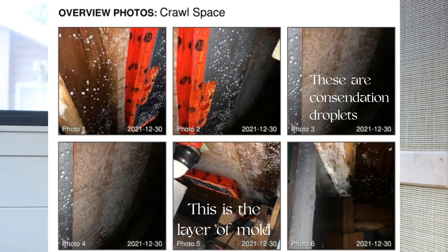Basically what happened — the reason why all of this started — was one day my water froze. I do have an insulated and heat-wrapped water line, but there's a little sensor that determines if it's below zero degrees to turn the heat tape on. That sensor was underneath my house, and because it was minus four outside but actually about two degrees underneath my house, the heat tape did not turn on. So I thought something was wrong with the water supply and called the folks at the park. They came and crawled underneath my house, and the guy told me there was a lot of condensation underneath — it was raining on his head. This was in December, and I had only moved in in the middle of September. So we looked under the house and lo and behold, there was mold growing.